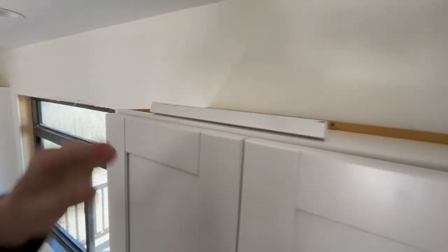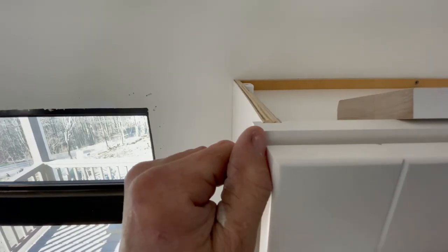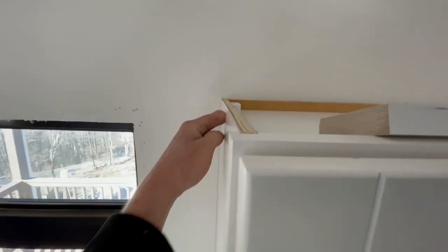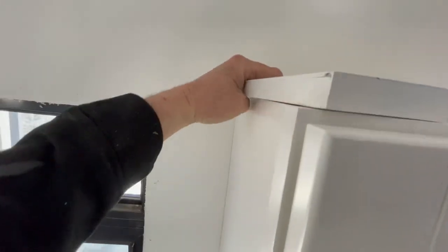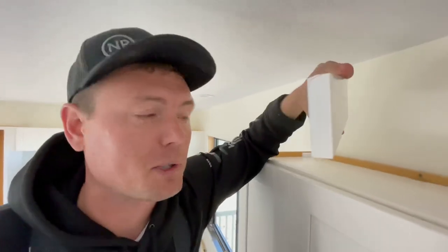It's also problematic where you have this little overhang on the side. If you try to do crown molding around that, you either have to notch it and make it flush with the surface, or pack out this surface with a quarter-inch rip strip to make it flush with the edge. We can get around that by applying this topper piece flush with the edge of the plywood — that's where the crown is going to wrap. We're lucky we have room above the cabinets to the ceiling to get a nail gun or screw gun in here. Sometimes it's so close — only three or four inches — and you'd have a really difficult time.